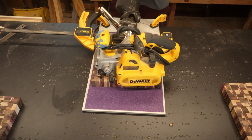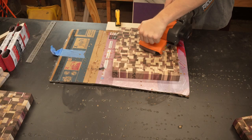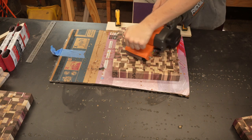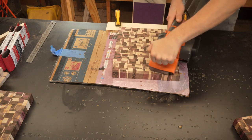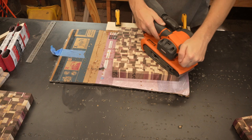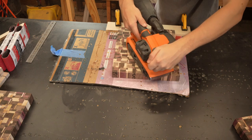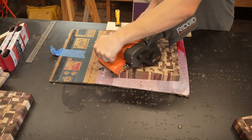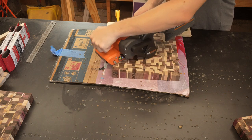After blaming the world and cursing my parents for having ever been born, I went to the big orange store and got an orange belt sander, and I'm really impressed with its performance. The boards turned out surprisingly super flat. I spent over an hour and a half with a 36 grit belt, which flattened them very nicely but left a lot of deep scratches. Then I switched to an 80 grit belt, which cleaned up those scratches by making much shallower, smaller scratches. But my boards are flat and they're looking pretty good.